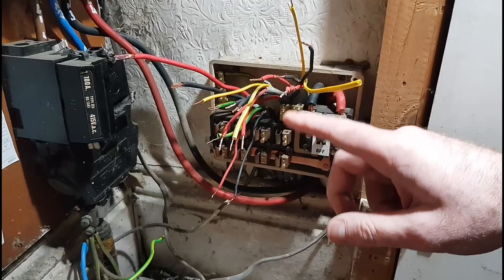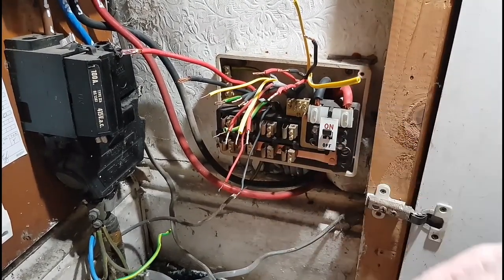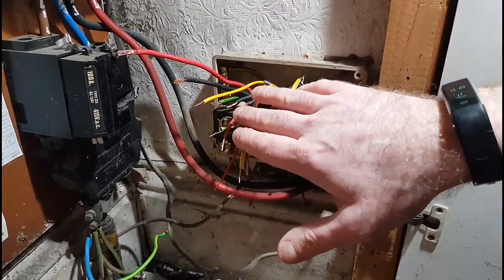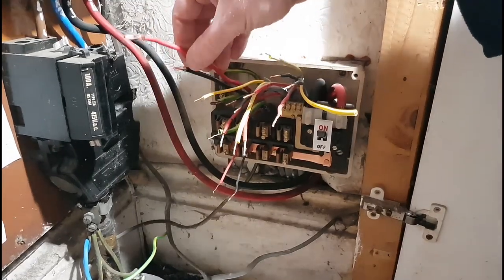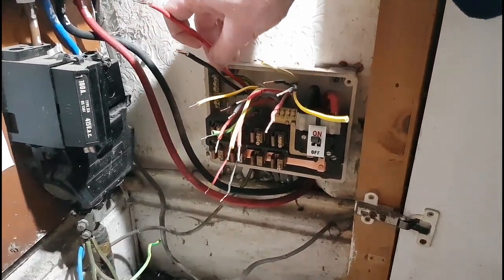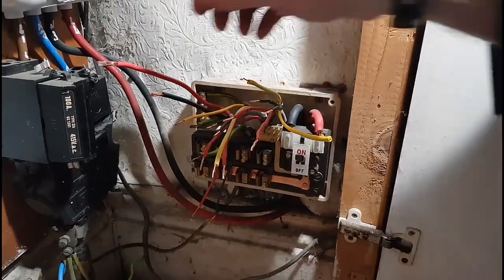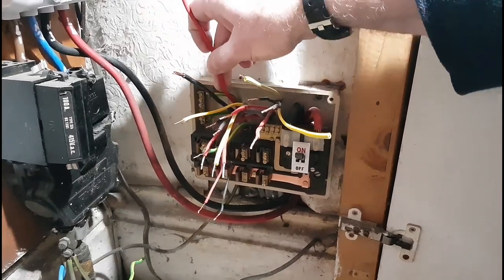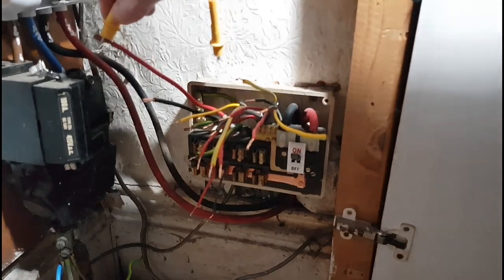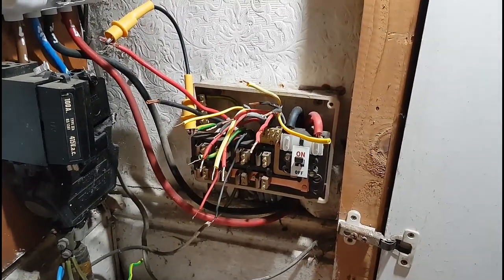I've labelled the sockets up, put a bit of pen on it. You can see there's two notches on that one and one notch on the other one, just so I can identify the circuits should things start getting a bit messed up. This potential shower circuit — we'll link it together and go and see what readings we get up there. There is actually no shower in the property, so it's interesting to see what's going on at the isolator. I'll get it all linked up now and we'll see what readings we've got upstairs.